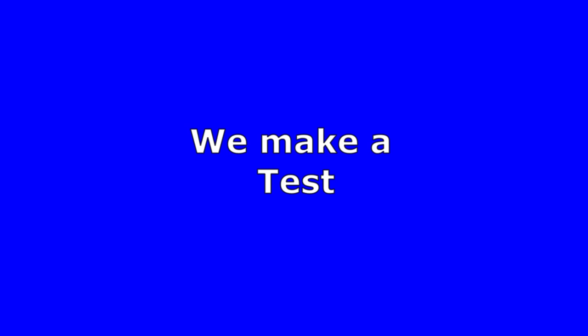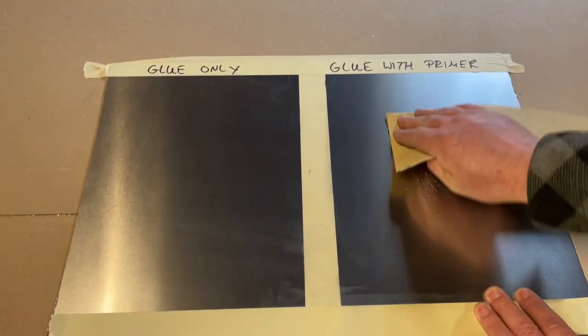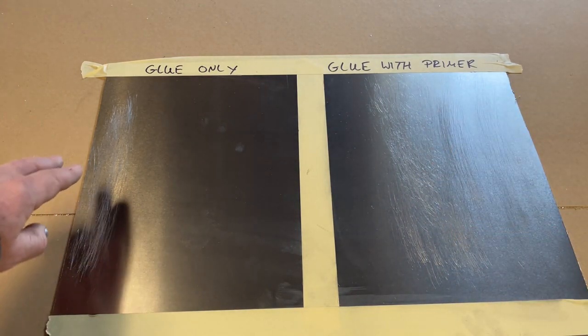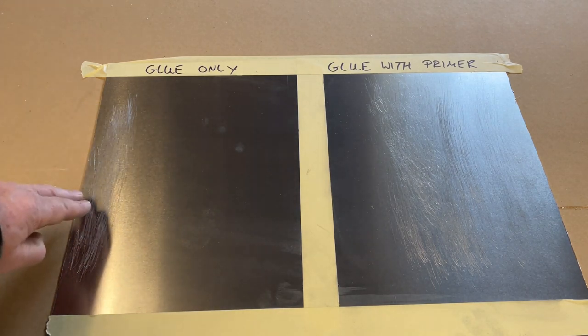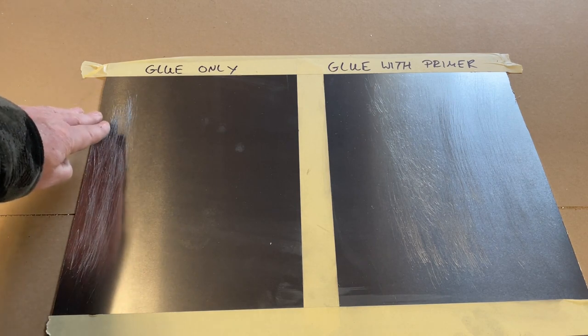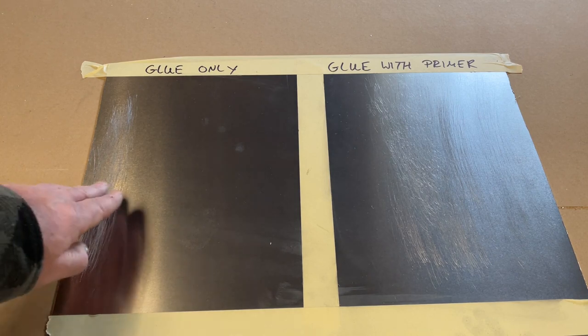Before we get into the details of how we use this material: I cleaned both sides, and sanded this side a little bit more so I can put a longer glue line on there. I also sanded just on this outside here because I'm going to put two lines on there — just one on the alcohol-cleaned side surface and then one on the sanded surface, glued without primer.